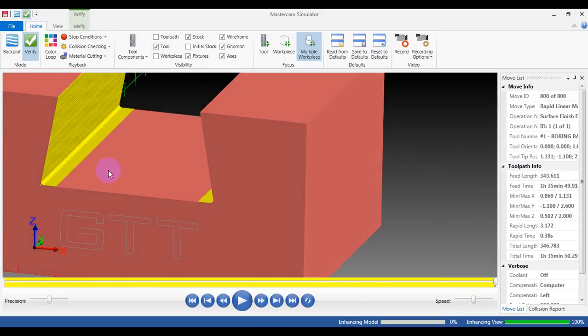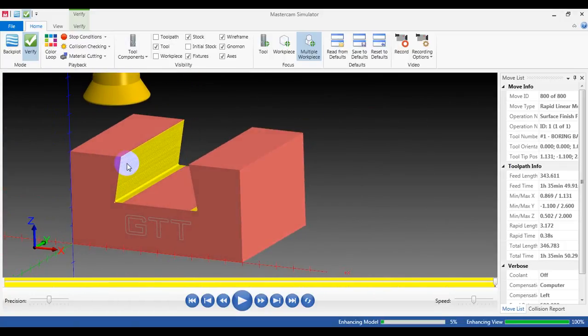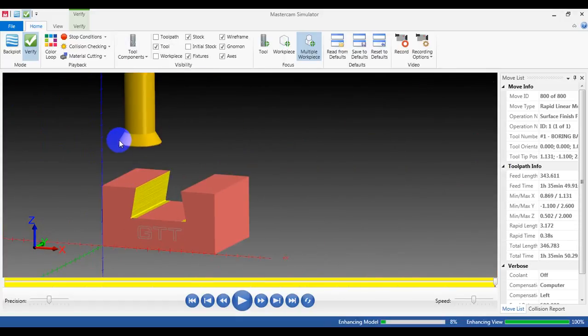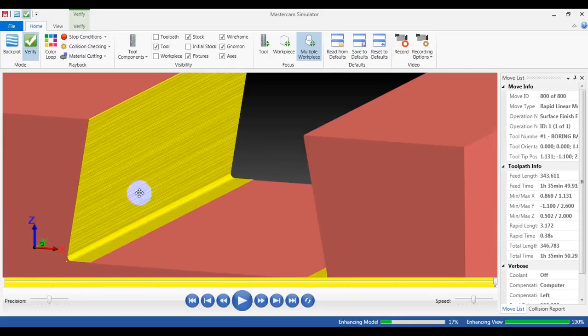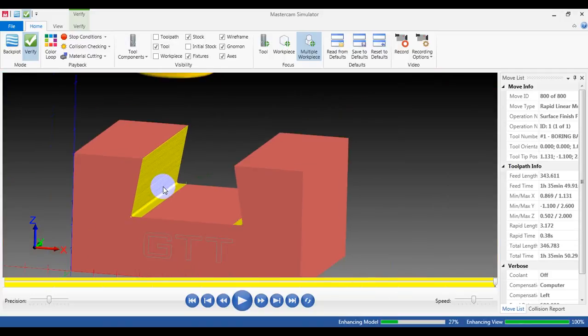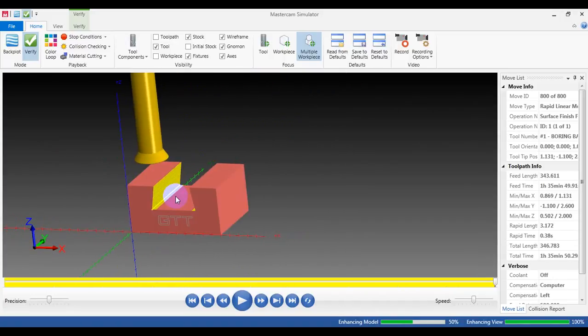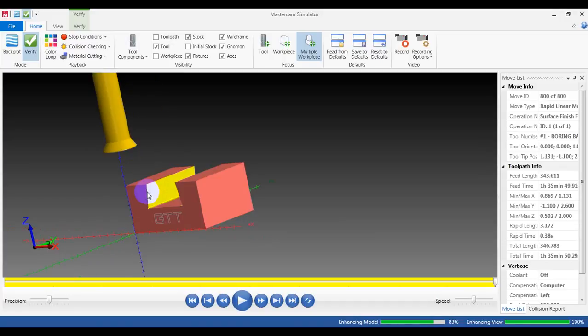So in theory, we can use the boring bar to machine a dovetail, but there's some problem first. Because the tool just contacts the surface by the corner radius, and the corner radius of the insert is normally very small, the surface finish of the dovetail may not be good. But you can change the step over to very small and do some sanding. Yeah, sandpaper may work. It's not a problem when you do a sample. You can spend more time on a sample if you can't find a dovetail cutter at the moment. So this may be a solution for this.